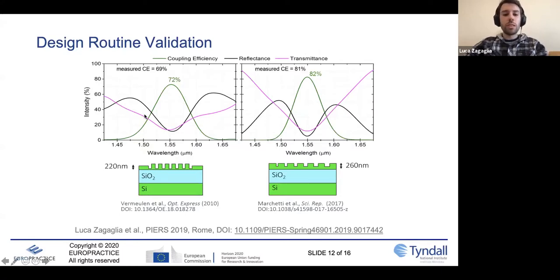Using the losses, we can also observe the behavior of the interaction between the electromagnetic field and the structure. For example, there is a difference between the transmittance of the uniform grating coupler and the transmittance of the apodized grating coupler. This is because the apodized coupler has better impedance matching, due to the varying pitch throughout the grating coupler — essentially creating a better bandpass filter effect that boosts coupling efficiency even further compared to the uniform grating coupler.